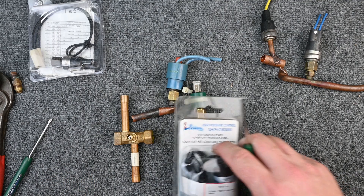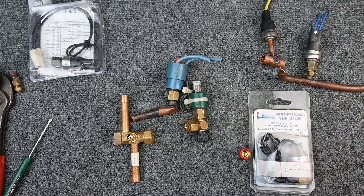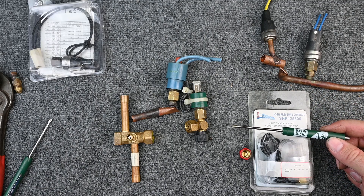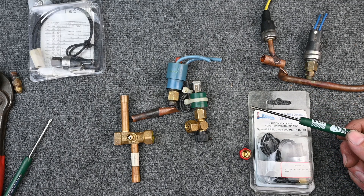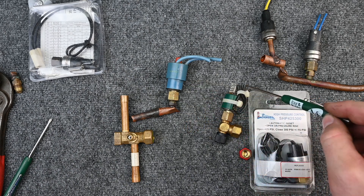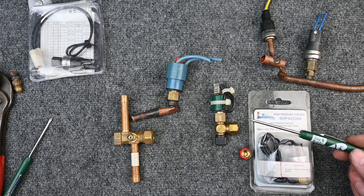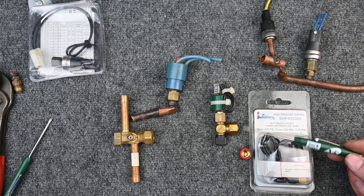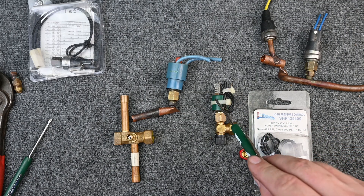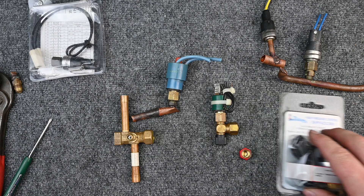These are the things you're going to see with a pressure switch. It may shut the system off to protect the compressor from high pressure, or shut off at low pressure, or when the system is out of refrigerant. But they also work as controls — you can make this switch bring on a fan to control pressure, or control other components. There are tons of things you can do with these switches beyond just safety functions.